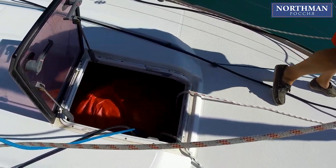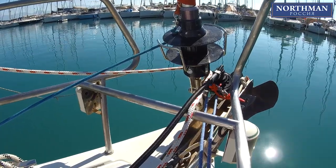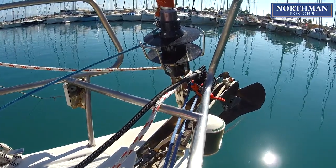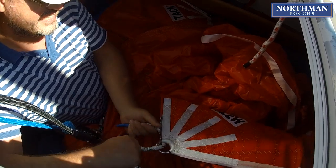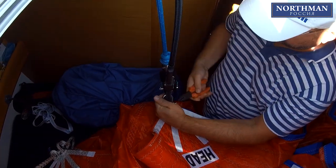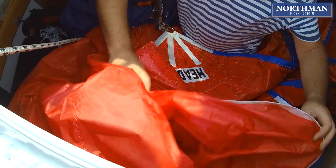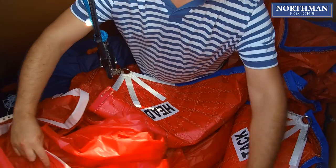Then the sail goes above the sheets. After that, unwind the torque cable coil and stretch it above the sail, clipping the lower end to the drum jaw. Now you can attach the sheets to the clew. The head of the spinnaker is typically latched to the soft-stay thimble which is fastened to the top swivel on the spinnaker halyard. Make sure that your spinnaker is not twisted and all the sides are free.